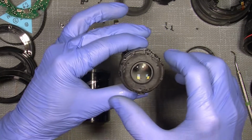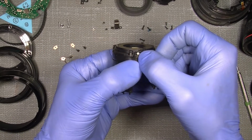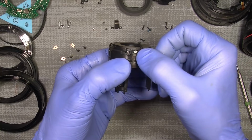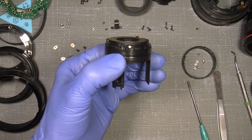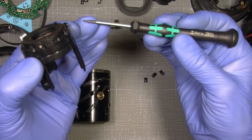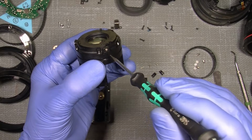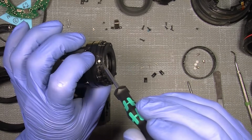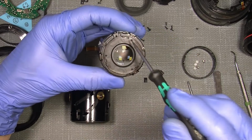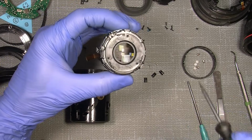And now this is very important. As I read on the internet, you see those small things, it looks like a screw, but it isn't. It's an eccentric. So when you use an Allen key, which is very small, this is a hexagon key 0.9, and this is really small, you can adjust those 3, not screws, but eccentrics, and it will turn the whole lens here around. And of course it has to sit correct.